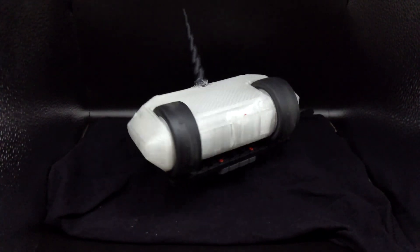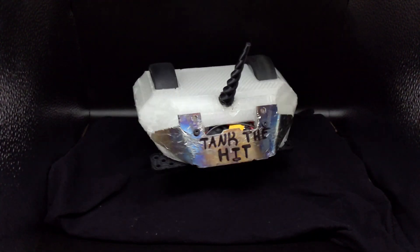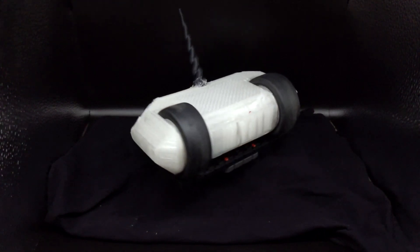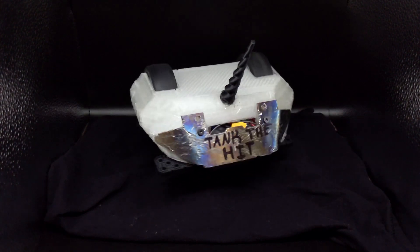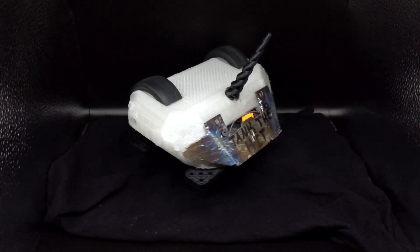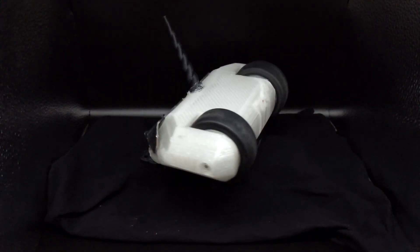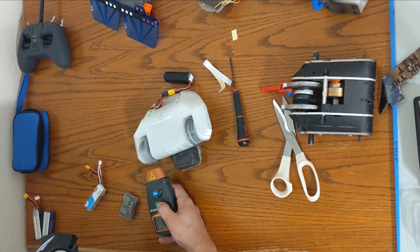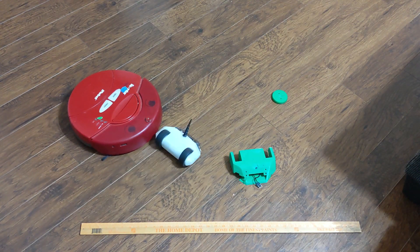The next robot is Potato. I made this for my girlfriend as a simple robot to get her started in combat robotics. It's got VEX retail motors, normally designed for 9 volts but running at 11.1 volts right now. It's had all kinds of different wheels — foam latex, TPR — but usually runs TPR. The diameter is around 63 millimeters, and the wheel RPM is about 407, giving a drive speed of around 1.35 meters per second.